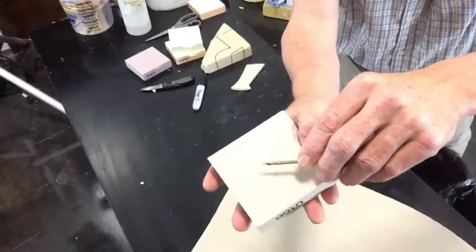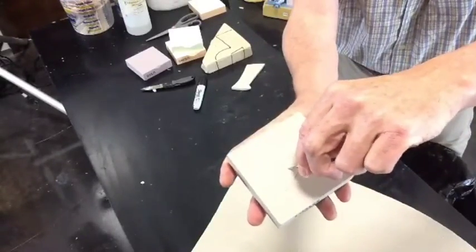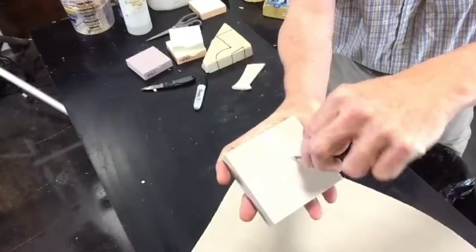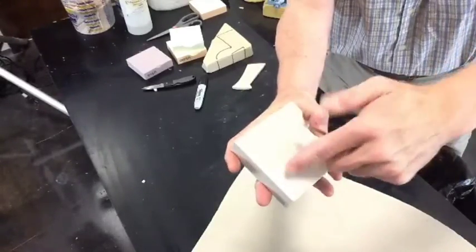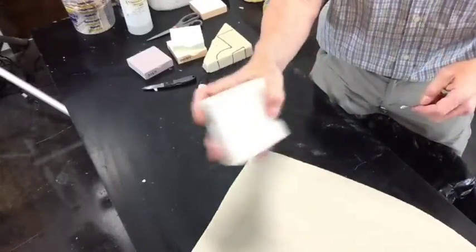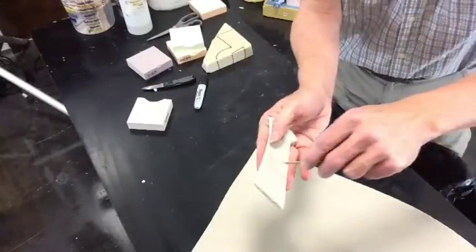Try it now. Is that better? Okay. There's lines going this way. Those are the pull marks from when I'm taking this tool and just trying to make cuts. I can also tell you that typically you don't try to hand carve with tools like this in a higher density foam. And in this case, even 10-pound is considered to be higher density. So that's why people use these low density products.